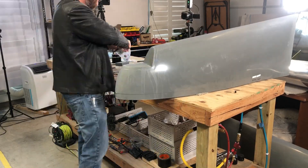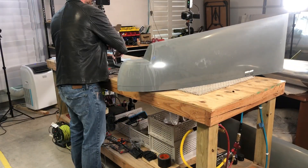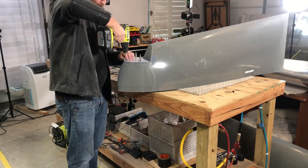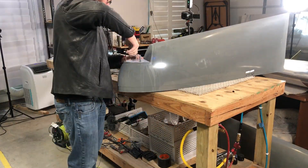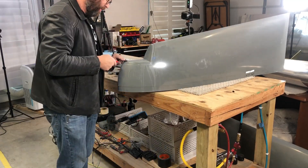It's just the white boards that go in the wingtips. We've already cut ours down and got it fitted to our wingtips — that was a really easy process. I did record a lot of video of me doing it; I haven't published it yet, so this might motivate me to get that out the door. I don't know if I did it right or not, but it seems like it's going to work. It's easily tested with a nine-volt battery, or for the strobe and position light part. The feature we do for our wingtip position and strobe lights is that I'm selling it as a kit of parts — a circuit board, a bag of resistors, a bag of LEDs — and I encourage you to get the soldering iron out.